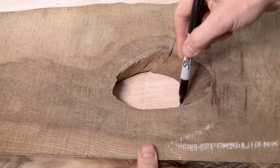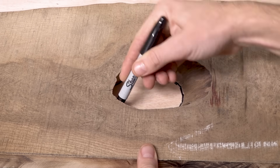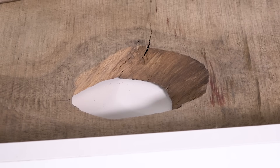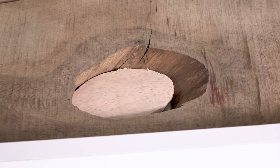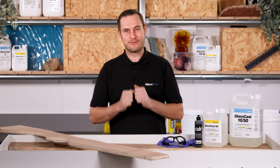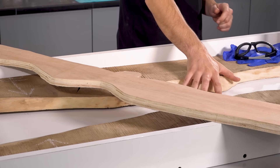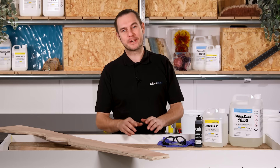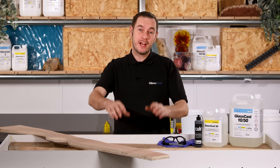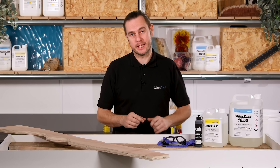Here I'm also making a plug for this large knot hole. If the knot were smaller I probably wouldn't bother, but unfilled a hole this size might use up to 300 grams of resin all by itself. So here we have all of the wood ready for the resin pour. Our plywood insert is going to take up the majority of the river cavity, and we've left a 5 millimetre gap underneath, around the edges, and on top so that when we do the pour it will be completely encapsulated in the resin.